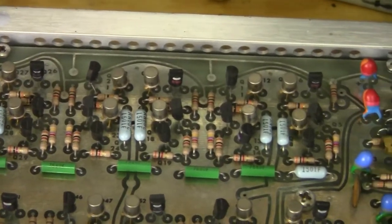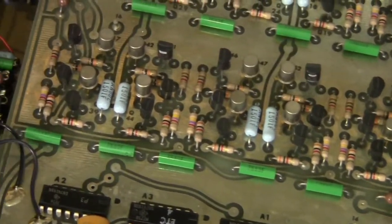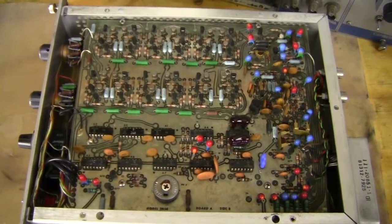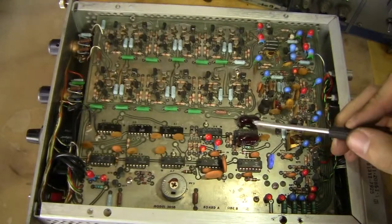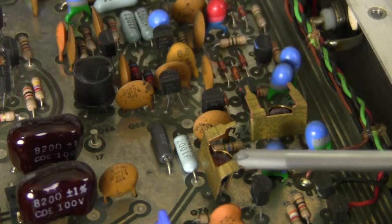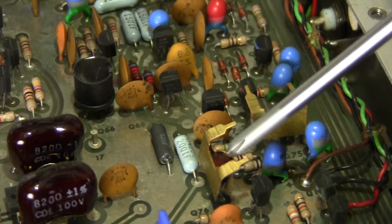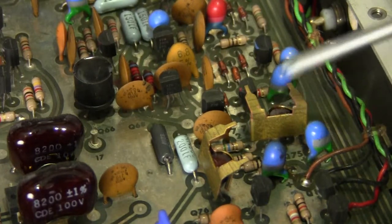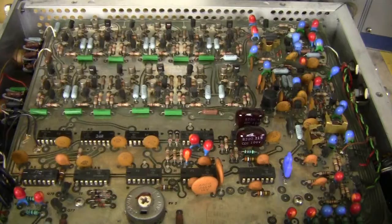Rows and rows of transistors doing something. You've got a second row right down there. One 10-turn potentiometer there. Two big capacitors over here. We've got interesting TO-3 package heat sinks right here — they've crimped them over and then put some sort of glue on top of them just to keep the heat sink down. I would think it's also conductive glue to provide a lower resistance path for the heat to get out. The board has a lot of discrete transistors — pretty interesting board.